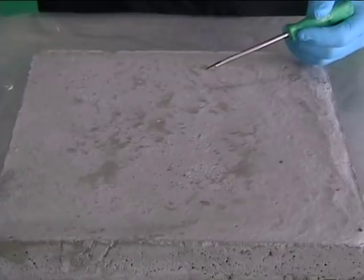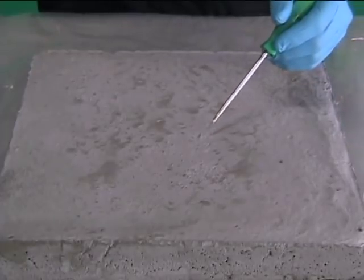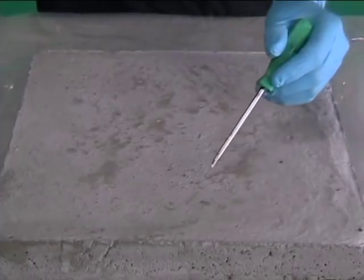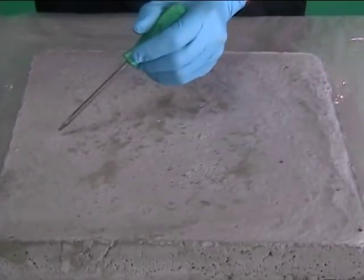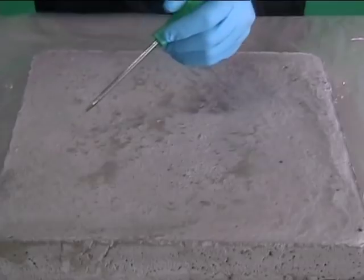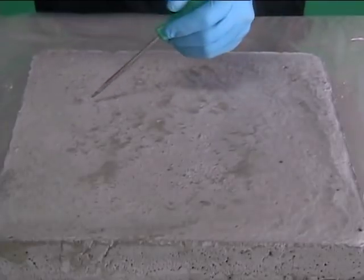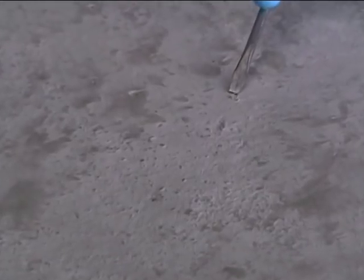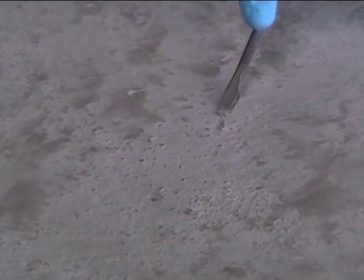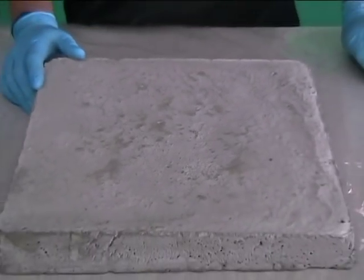In our example, the concrete surface has a very thick layer of calcium sulfate on it. You can see how the material covers the surface in varying degrees. The amount of calcium your project may have on it will directly depend upon the concrete recipe used when the concrete was first mixed. As an example, we use a screwdriver to gouge at the calcium sulfate on this sample. As you can see, it is very powdery and easily scratched off.